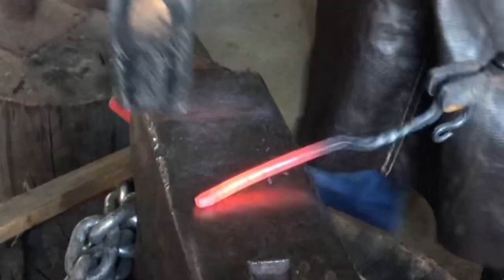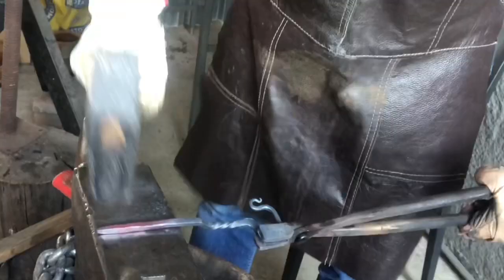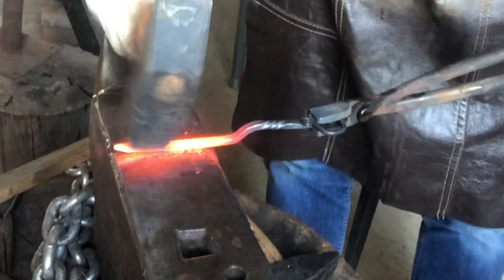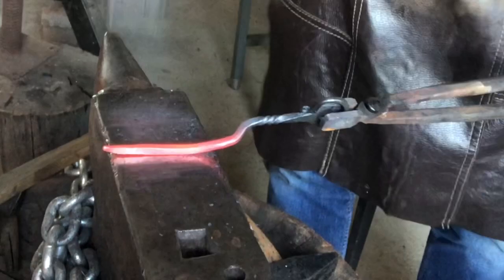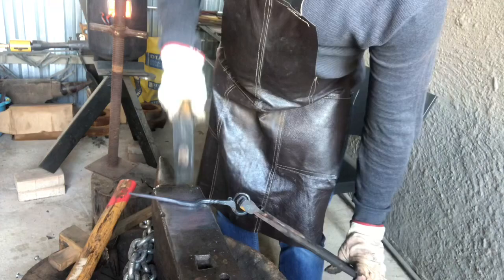make a sharp point, and then forge it, stretching it out into a longer tapered shape, and that will be the ice pick part of this little bar tool. Yeah, I'm just stretching it out a little bit more. I did 2, so I'm not sure which one I'm working on at the moment, but yeah, stretching it out into a taper, and I'd leave this quite rough because I like the hammered edges. I think it looks pretty cool.